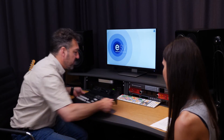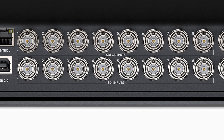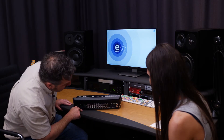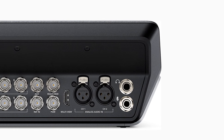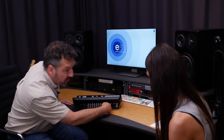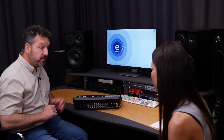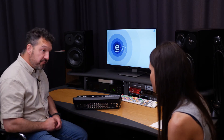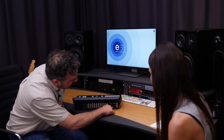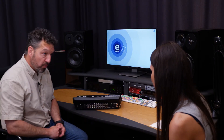If I just take you around the back of it — here we have the eight SDI inputs and eight SDI outputs, so they sort of loop through. We've also got a reference in and a couple of auxiliary channels. Unusually, we've got a 4K multi-view output, so you get a much sharper preview of all your images on an output if you use a 4K television. And we've got two channels of balanced XLR audio, and the mic and headphones for the talkback system.